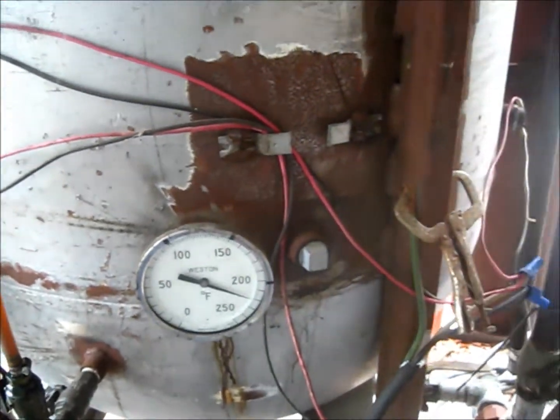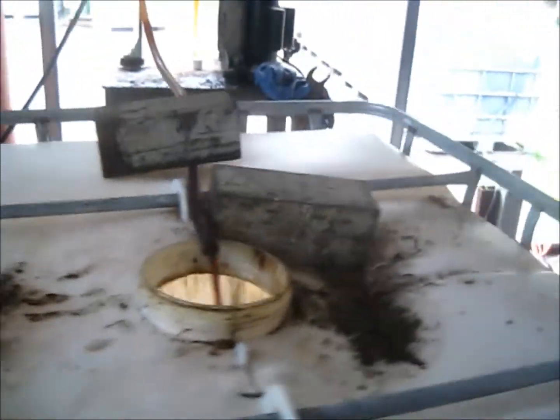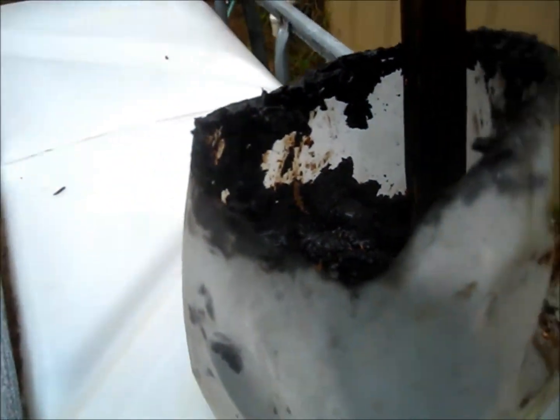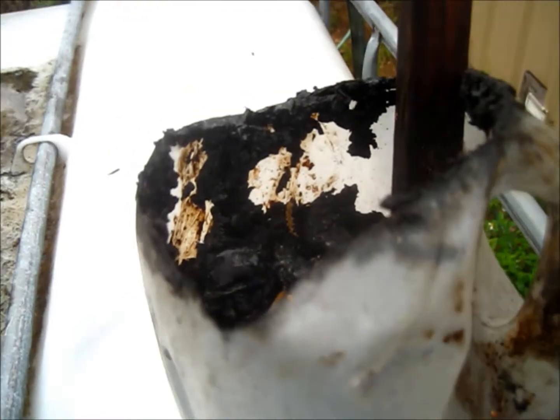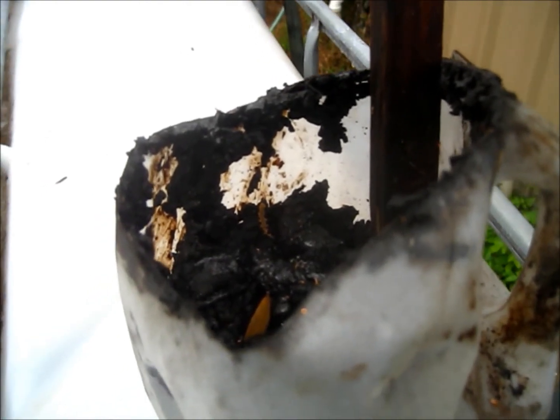Water is a bad thing. Fat's a bad thing. And the fines — the really fine particulate — all help to cause you problems with your filter. Let me get right out here in the light so we can see it. You can see how nasty this stuff is, and if that was in your filter you wouldn't be going very far. Many of you have probably experienced, like I have, that if you press oil into service that's contaminated, you're sitting on the side of the road in a very, very short period of time.